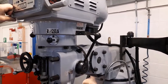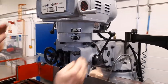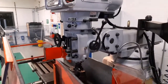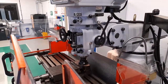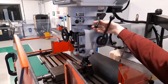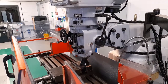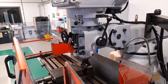It should be noted, however, that when the gear range is changed, it alters the direction of rotation of the spindle. It can be seen that with the high gear range, the spindle is rotating clockwise. In low gear range, the spindle rotates in reverse — it rotates anti-clockwise. If the cutter is used rotating anti-clockwise, it will destroy the cutting edges and also probably damage the workpiece.